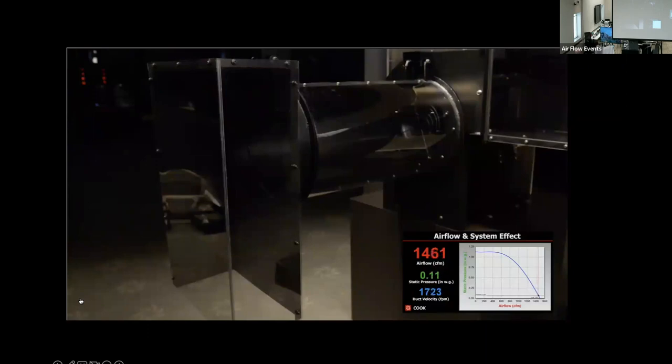It should be noted that the box is 19 inches by 9.5 inches. The ratio of these two dimensions is referred to as aspect ratio. The aspect ratio of this fitting is 2:1. The closer the ratio is to 1:1, the better. The larger the aspect ratio, the more pinched the entrance to the round duct will be, and the more dramatic the pressure loss of the fitting.